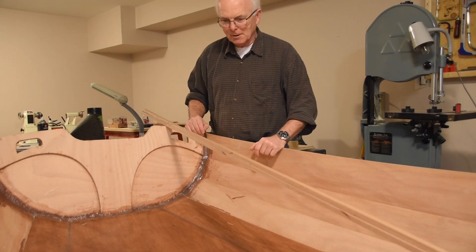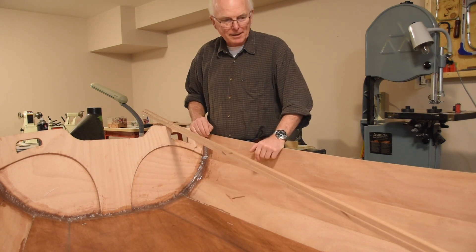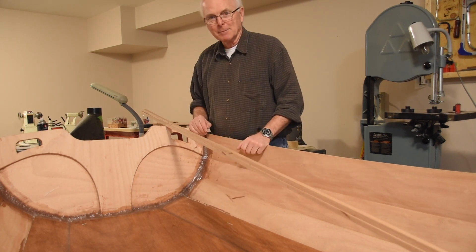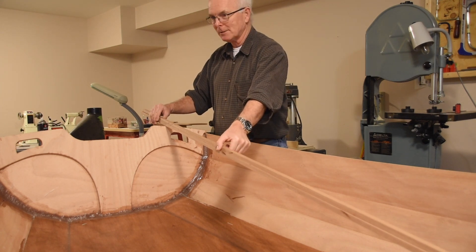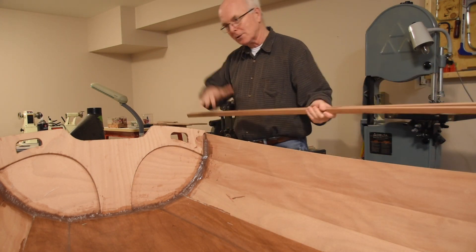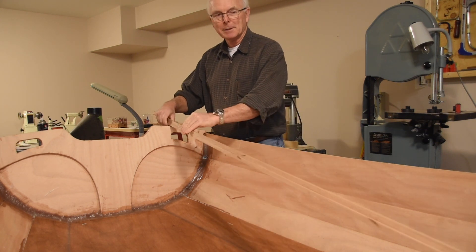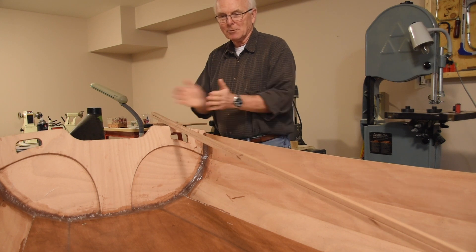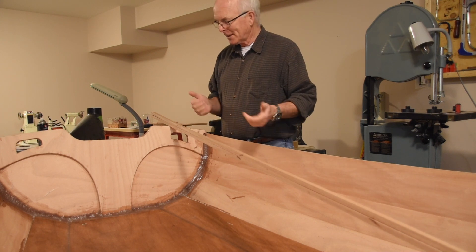Last night we finished off by laying the fiberglass cloth down on the bottom of the boat. We've got one coat of epoxy on that, and we've trimmed the fiberglass at the top of the first panel. So we've done all we can on the bottom right now. The next step according to the plans is to put the gunnels on — it's actually two pieces on each side, laminated together and onto the boat. But I'm going to hold off a little bit because this boat's going to be a tender, and I'm concerned about hard wood bumping into the hull of the large sailboat and the damage the wood rail might cause.